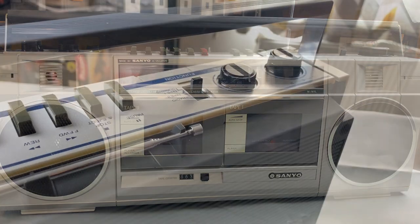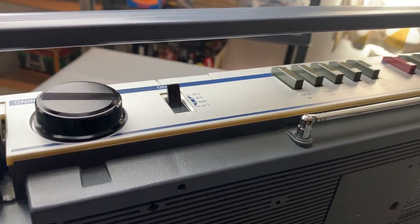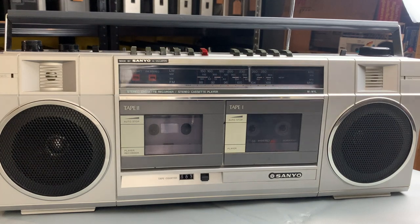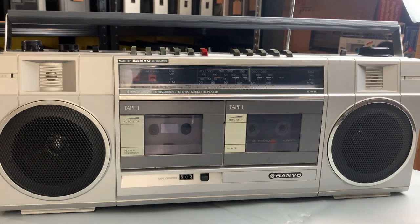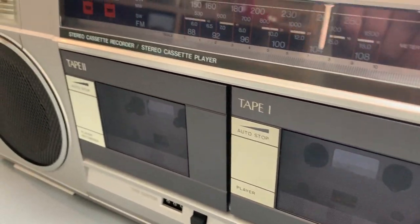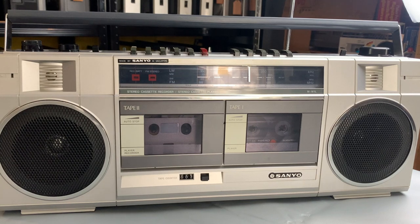Fantastic. So all the lights work, all the switches and knobs work properly. We adjusted the tape speed - I think you can actually get to the motor through some tiny little holes just under the cassette doors as well. So we adjusted them in situ whilst we were doing the belts, which was dead easy. But I think you can actually make fine adjustments there as well if you wanted to. But anyway, there it is - the Sanyo MW1L. What a beast - it's the first one we've had in on the channel. I hope you did enjoy the video. If you have one perhaps you even found it useful if you're looking to do some maintenance or service work. Thank you very much for watching, please do consider subscribing and hitting the bell - we've got boom boxes, eight tracks, personal stereos, vintage games, all kinds of retro gear. Thank you very much for watching, stay safe, and I'll see you soon.